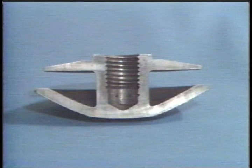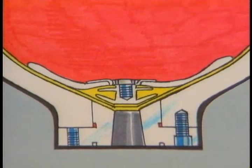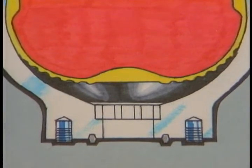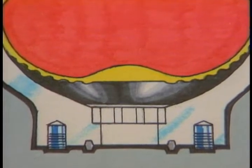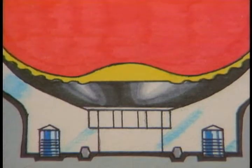The diaphragm in the Hydral unit contains a steel insert in the bottom of the diaphragm. This helps create a proper seating position and keeps the diaphragm from sticking out the fluid port. Continental EMSCO uses a perforated retainer plug over the fluid port and a slightly thicker diaphragm. This helps to serve the same function as the insert on the Hydral unit.